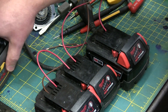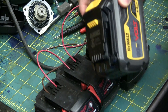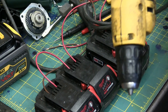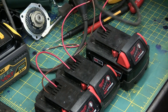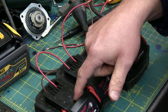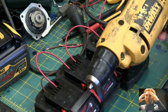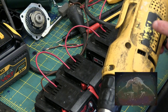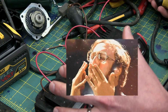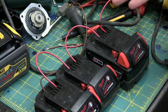Okay, we're done with the foreplay — we're into the meter. This setup here is 60 volts DC, direct current. Same as this battery — if we could get it to output, it'd be 60 volts as well. We have here a corded 120-volt drill. The plug is hooked up to the positive and negative of the battery, and these three batteries are series'd up: 20 volts, goes to 40 volts, goes to 60 volts. Contact! Here we have a 120-volt AC drill running on DC batteries. Fucking mind blowing — I know it gets better. How cool is it to be able to run a corded tool off batteries?